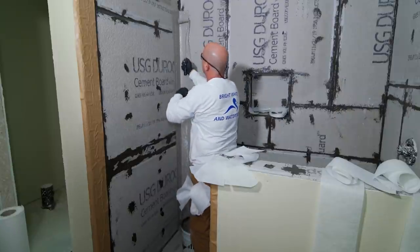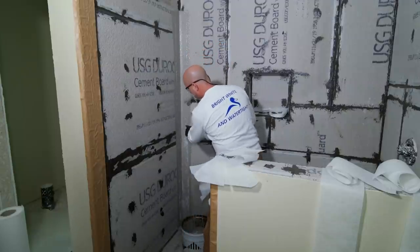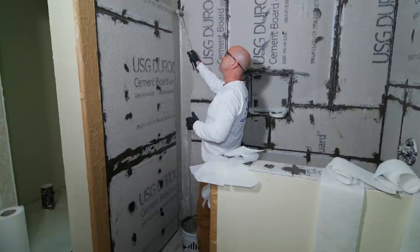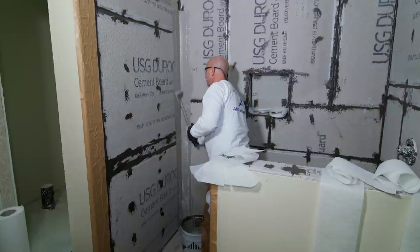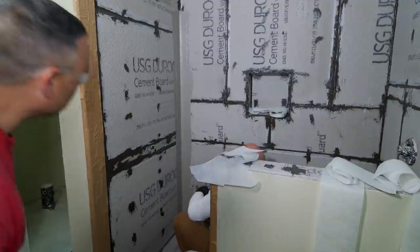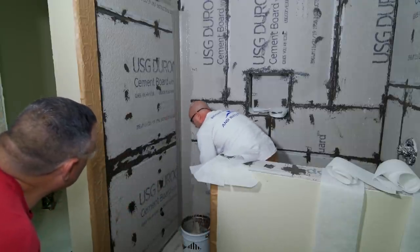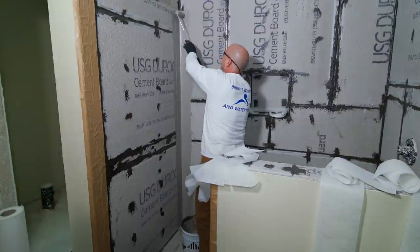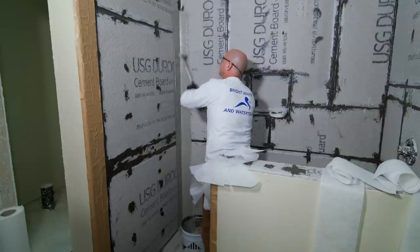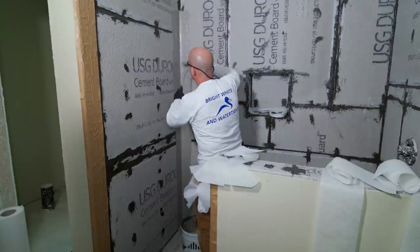Now all that excess I've got out there — I'm trying to grab that material and bring it back into it as well. See white spots like this? That shows you that you're under-saturated. You've got to make sure you have a little bit of a shine to it — that way you know you've got enough on the top side. No dry fleece. So does it look like we have it nice and flat, up against the wall like we need? If so, now we need to make sure it's saturated. I'm going to grab that excess and bring it all the way down, dragging it back into the tape itself, mostly concentrating on not shoving air inside of it.